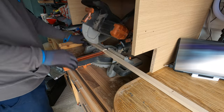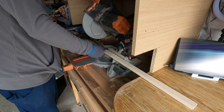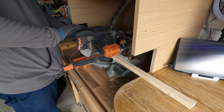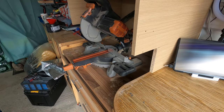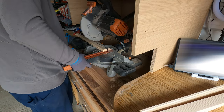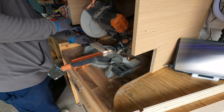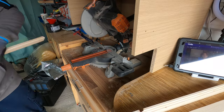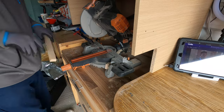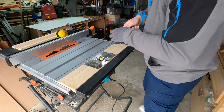With the groove in, the next thing was to cut the pieces to the correct size. I set up a stop block, and this was where I made my first sort of mistake — although I still don't understand how. I'd measured all the lengths correctly, but that very last one came out about 10mm short. I also realised my bench was slightly out. So I went along and took about 2.5–3mm off the end of all the other sticks until they were all exactly the same size.